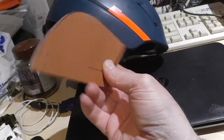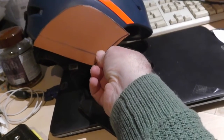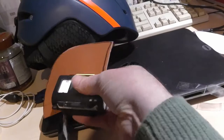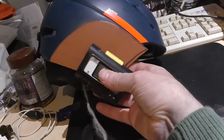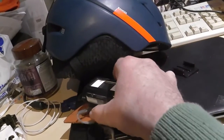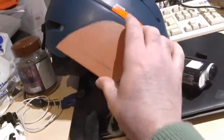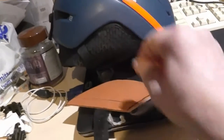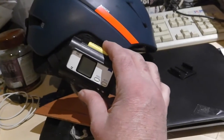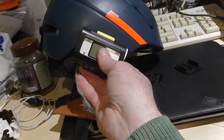I haven't done anything with this thick a piece before. The plan is: cut it to fit, heat it up, mold it to fit, make a hole in it, attach the camera, screw through from the other side. Because it'll be attached all the way along here, you don't get that turning moment that would snap off a single bracket — far less strain. It's also going to be a lot closer to my face, down out of the way of my goggles. I did look at a chest mount but then I'd have to wear a strap, and this camera works really well for a helmet because it's so slim — fits nice and neat, unlike a GoPro.